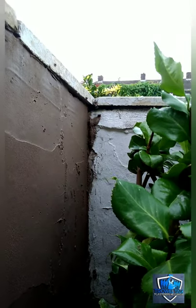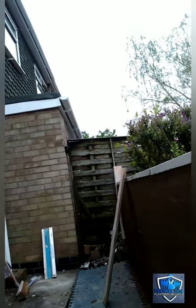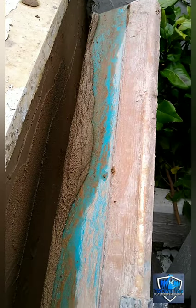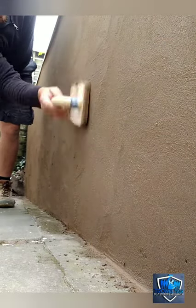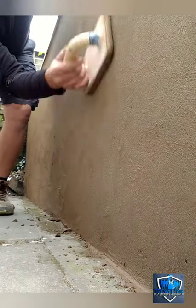For those of you looking to get into sand and cement render, I'd suggest practising on your garden walls at home, or if you've got a family member willing to let you have a bash on a garden wall, get your confidence up that way before you tackle any jobs. It is very different to internal plastering — it's a different set of skills. The skill is really on the rub-up, not so much the trowel. The trowel is just used to fling it on — it's more rolling and rubbing as opposed to trowelling. It's also very heavy material, which is why you have to build it up in layers.